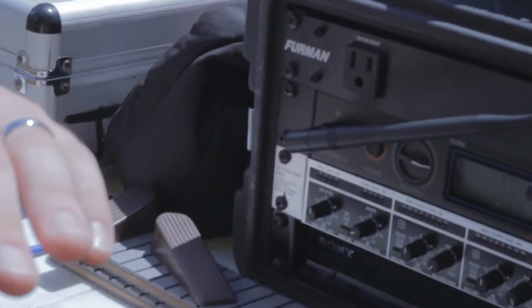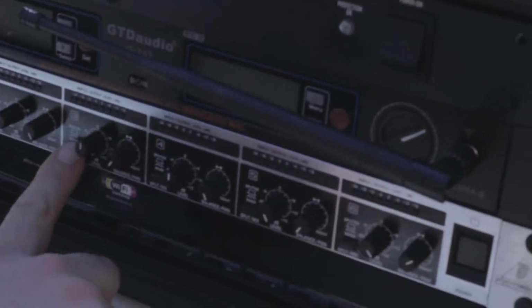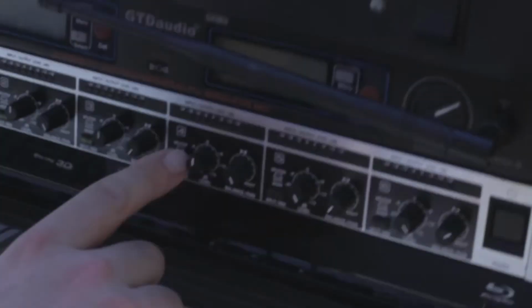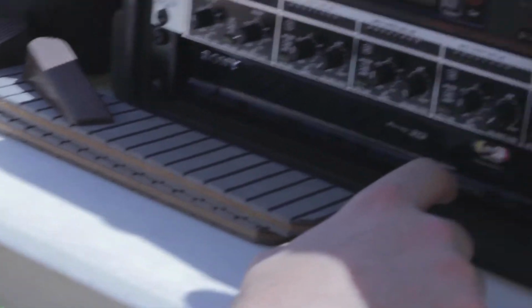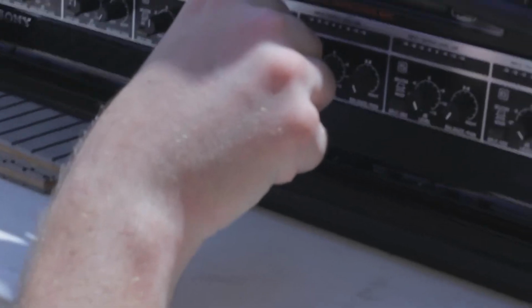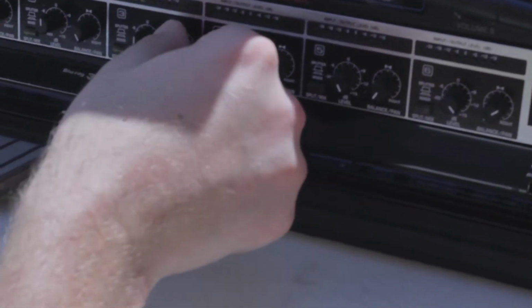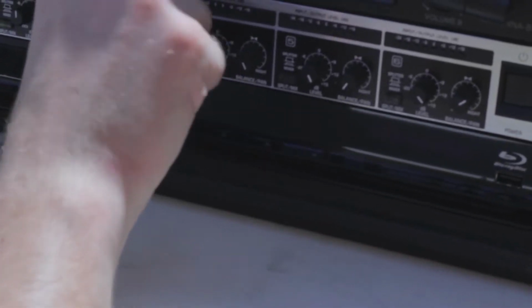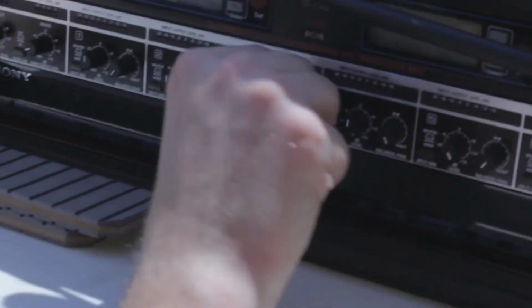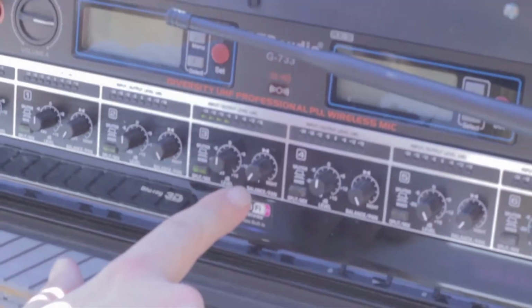Turning the mixer up. I'm gonna go ahead and turn off channel 3. Or sorry, channel 4. And so now we're just taking a look at the left speaker. As you notice, as I pan that right, it's going to that other speaker that's working, so that house right speaker. So it would appear that we just have a bad XLR cable.